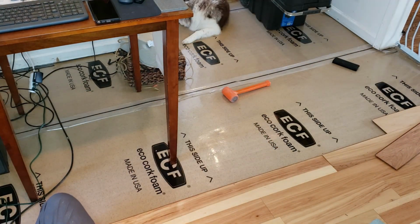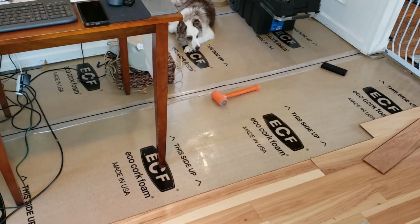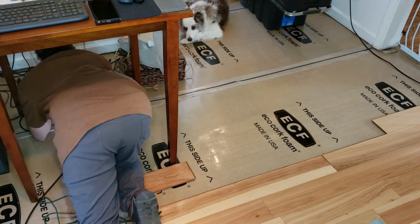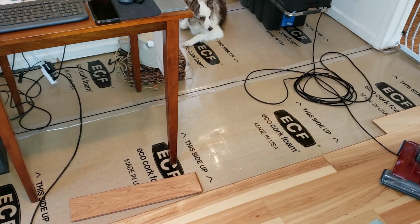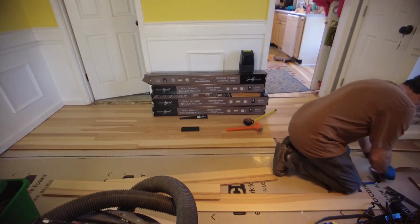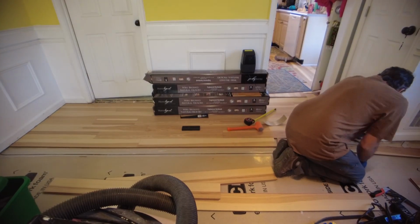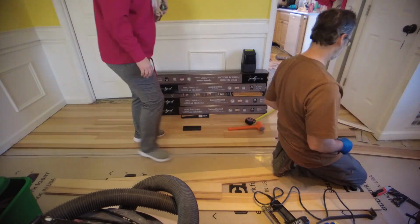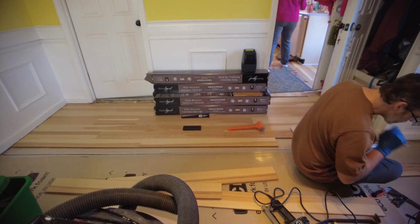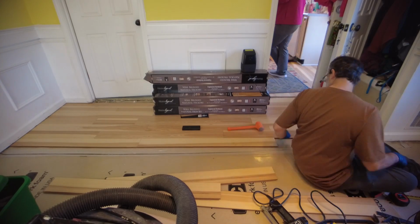The job that I did before this job, about this time last year, I installed a very durable plastic-based, vinyl-based floor with a rubber backing. Now, this is another lesson to learn. I learned a lot of lessons doing this floor. First of all, don't trust salesmen. The salesmen are going to tell you you don't need an underlayment with these floors because they come with a foam backing. That just isn't true. It's not enough of a backing for these types of inconsistencies and material to embed, and for you to deal with any inconsistencies in the floor. So don't believe the salesman.